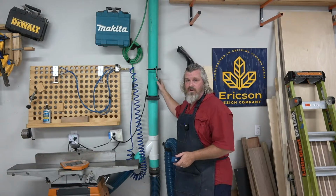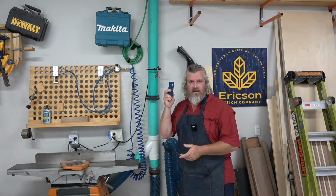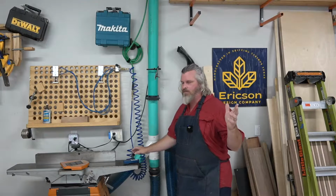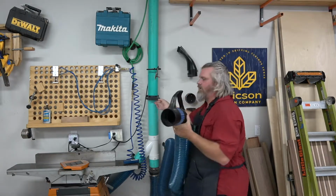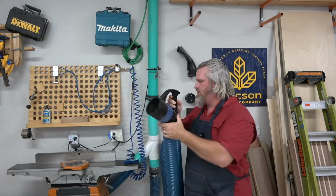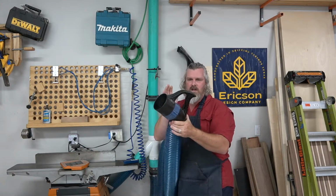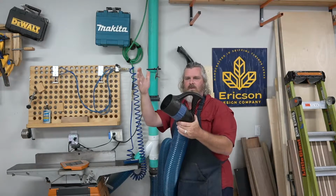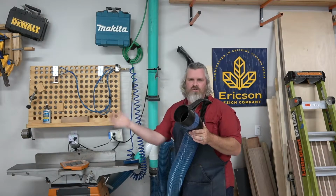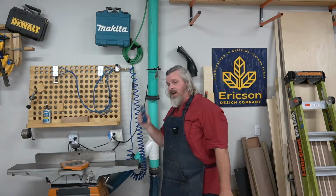But because I bought that sander, the little vacuums that I had for dust collection wouldn't work, so you have to upgrade. So I upgraded to the 1250 CFM Dust Right dust collection system. It's in the attic. You turn it on, super quiet. And this, for all of my tools that roll out in the shop, that planer, it gets all the chips. For the Jet 1632 drum sander, it wouldn't be able to work right without this. This gets 95% of that dust straight up, that fine dust. So upgrading for different projects is important.